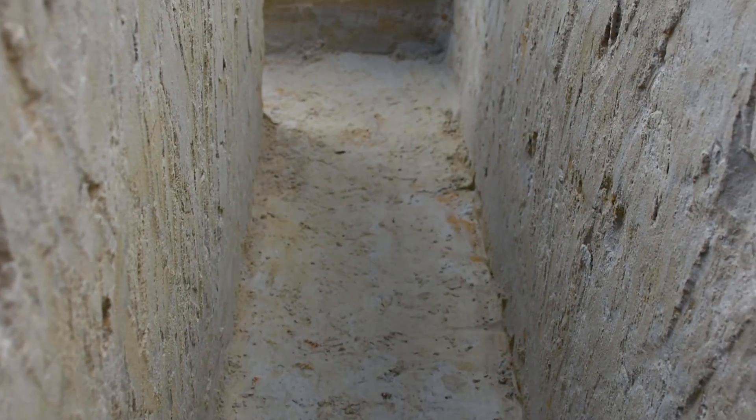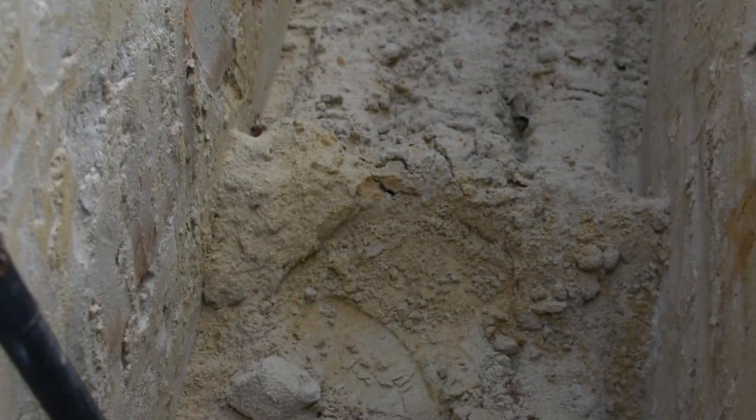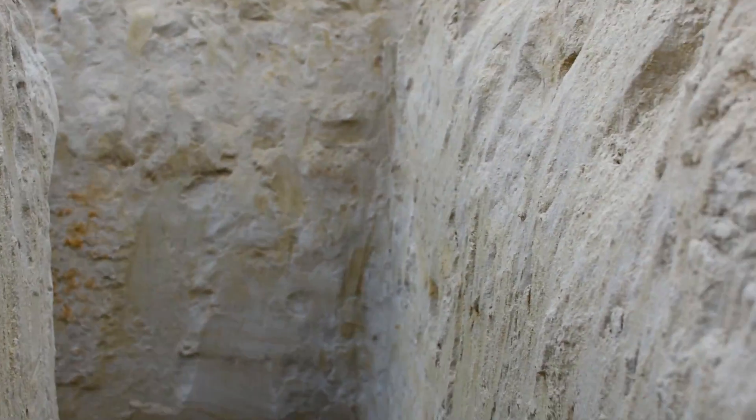That is the one I've just done, bottomed out. It looks nice, flat, even. If I quickly switch around here, you can see it through there — it is just a mess. And this here is all soft, look. So you don't really want to put a ton of concrete on that because it'll compact it and move. This here is hard, nicely bottomed out, and that's what the building inspector will be looking for.